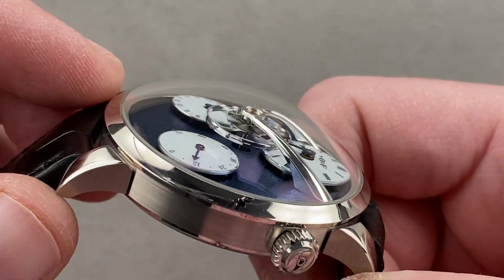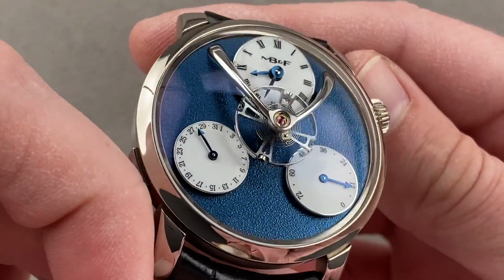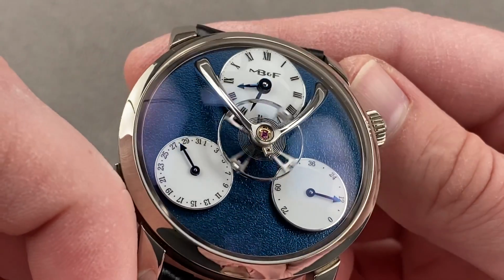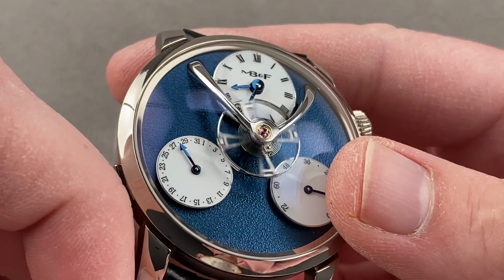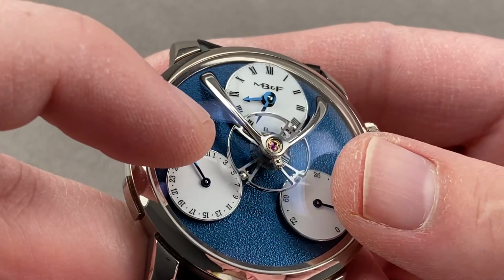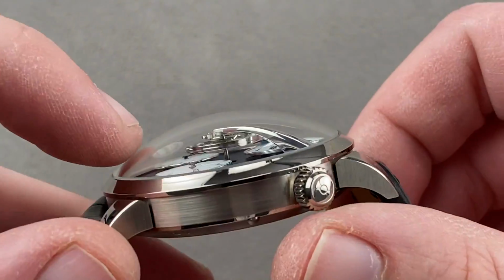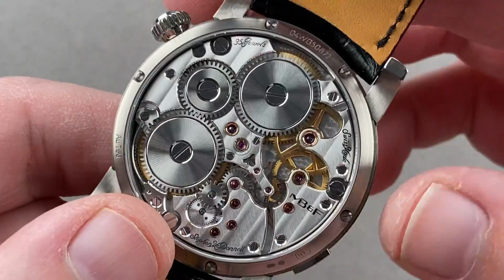You can really see that that balance is the highlight of the dial, as it is simply immense. 14 millimeters in diameter, and thanks to the 18,000 vibration per hour beat rate, it is a lovely chugging pocket watch cadence. You can also see those recessed bolts, which improve aerodynamics and allow for very precise regulation through variable polar moment. Turning it all over, by the way, take a look at the size of the balance staff. It extends from a case back where